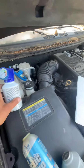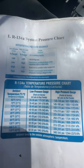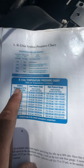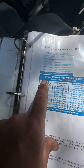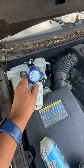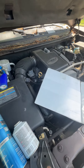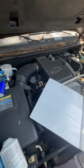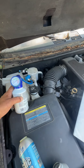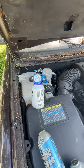Make sure that you pause this and take a picture of whatever you need. This is the complete chart of the outside ambient temperature and the pressure that's going to be on this gauge that you must match. If you do not match it, it's like putting antifreeze in a cold radiator — you're going to think, where did it go? You didn't let the antifreeze get through the whole car and the thermostat open. So you'd think you have a leak, but you just didn't do it right.